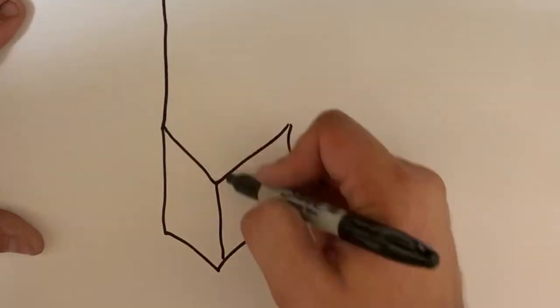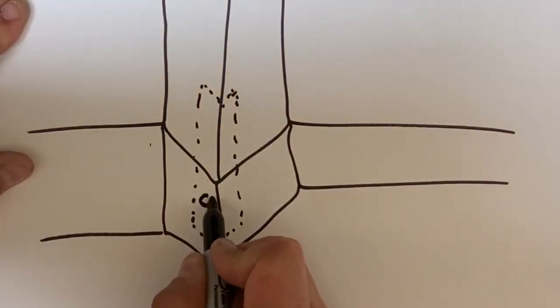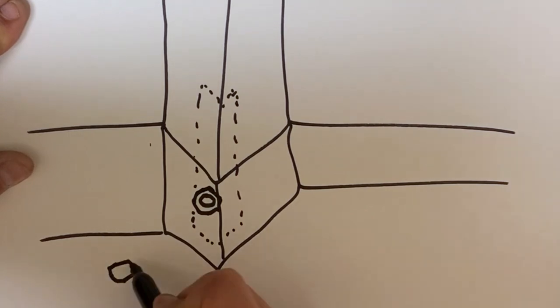After that's all done, we're going to go ahead and drill holes in the side of the angle iron and weld a nut inside of it so that way we can take a screw to the outside to keep everything tight.